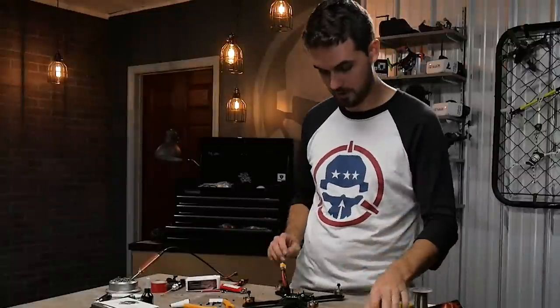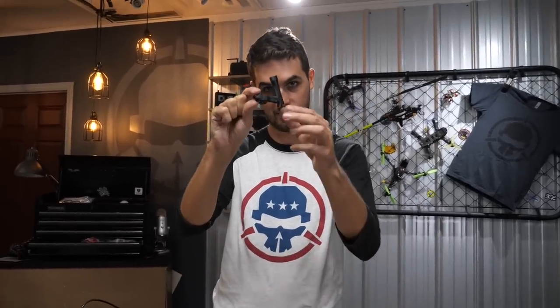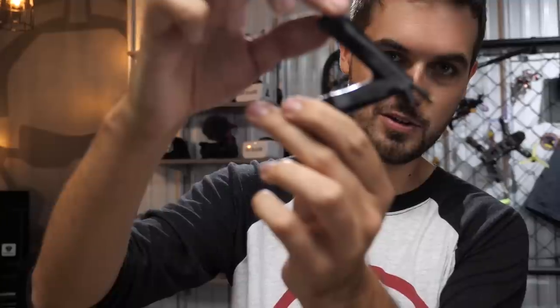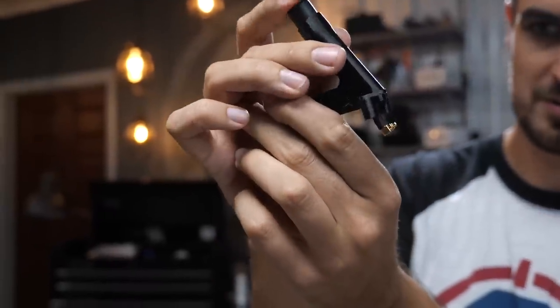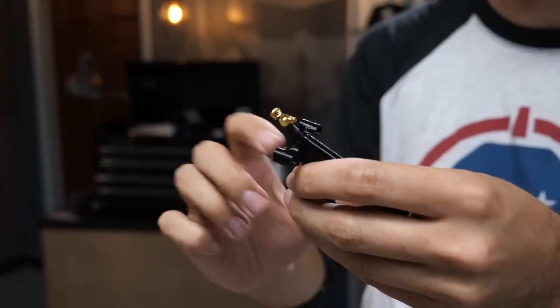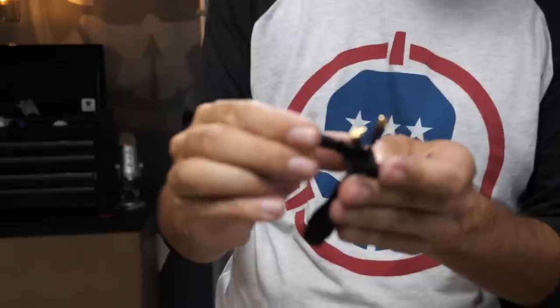Before we put on the flight board, let's mount the air unit, antennas, and antenna holder. The antennas plug into the back of the air unit, but first slide them into the antenna holder — slip the connector through. Before pressing the lobe of the antenna into the print, twist it so that the connector is oriented with the bend facing toward the front of the drone, then press it in. Get two standoffs from the frame kit, slip those on along with the little sleeves that cover the rest of the standoff, then mount this to the back with two short screws from the frame kit.